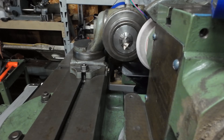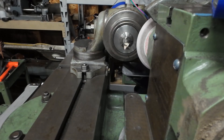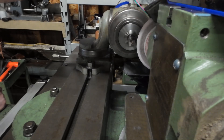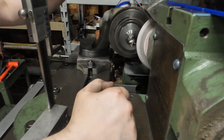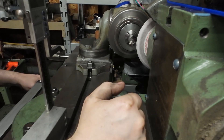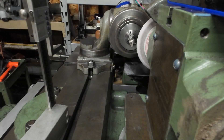The axis of our spindle where the grinding wheel is mounted is at the same height as the axis of our end mill — they're on the same plane. Now I'm gonna find the contact point of my end mill, and try to get the cross perfectly horizontal using the offset setting. Let's try 10 degrees more — getting close — about 5 degrees. That's going to be our relief angle, defined by the first point of contact with the wheel. That's all we need to do.